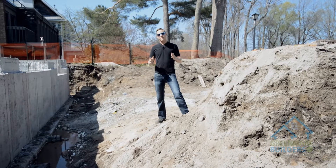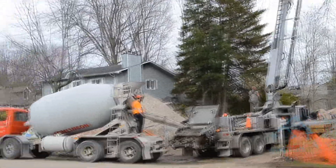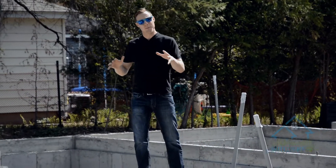Within 24 hours these forms will be taken off, loaded up and on to the next job. Although concrete never fully cures, after 28 days that's when it's reaching its maximum strength.